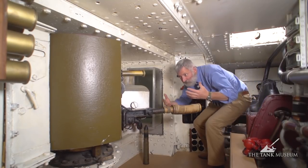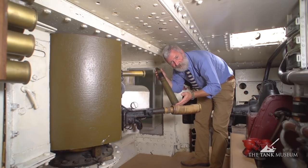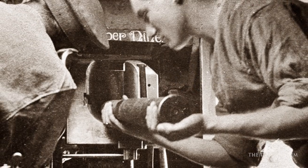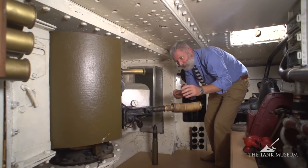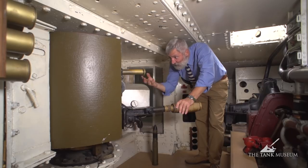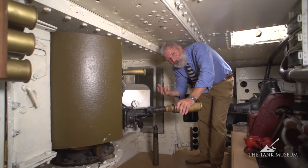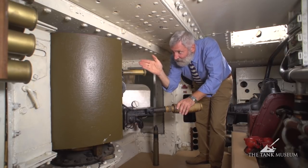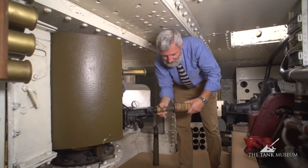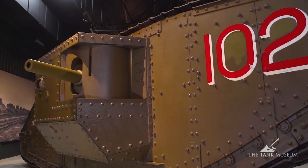Just in front of the gearsman's position is where we'd have two gunners on either side. There's a loader picking up the six-pounder rounds. The six pounder refers to the weight of the projectile — nowadays we judge the gun by the barrel size, about 57 millimetres for a six-pounder gun. There are stowage points all around the vehicle for six-pounder ammunition. On a female tank you would have Lewis guns or Hotchkiss guns on the sponsons, with spaces for boxes of ammunition. The gunner looks through a two-times sight and uses a piece here to elevate or depress the gun; side to side, he leans his body weight on it to get traverse.